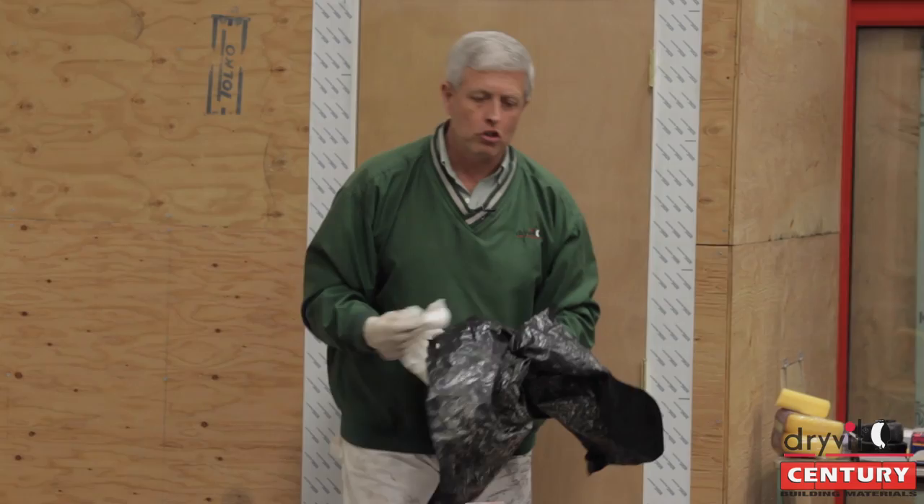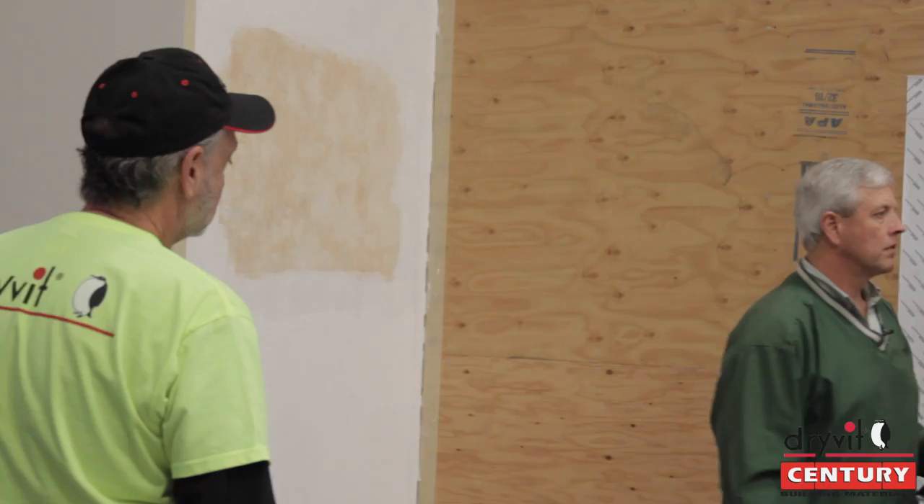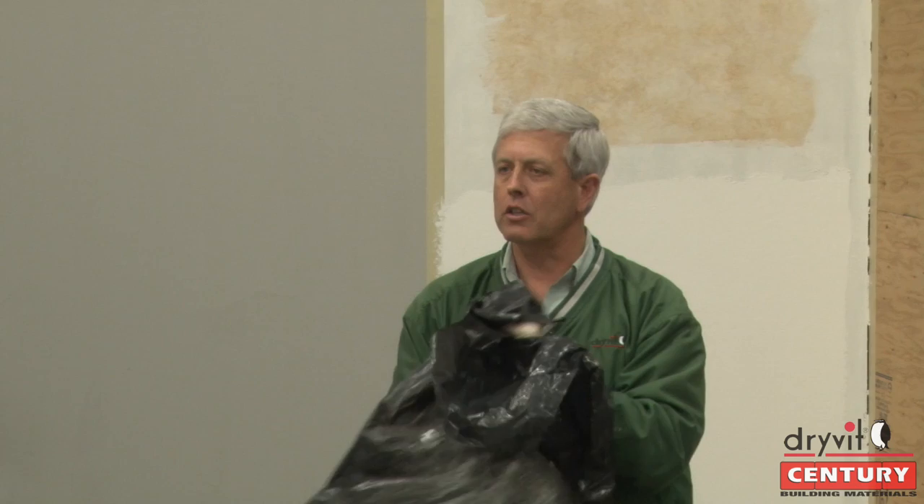Just a piece of plastic. If not, you can use a sponge. But the big problem with a sponge is if I don't do the exact same pattern, I'm not going to achieve the appearance that I want. So a lot of times I'll carry a rag, but more importantly the best tool is just a piece of plastic. Roll it on the wall surface, and once you get it wet, just keep overlaying and going multiple directions — wrinkle it up any way that you want and pull it right back off. It's that simple.